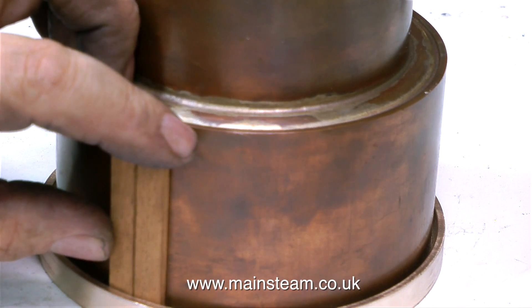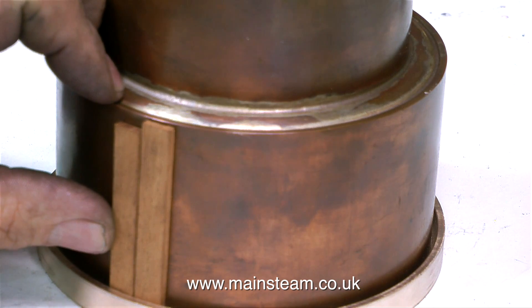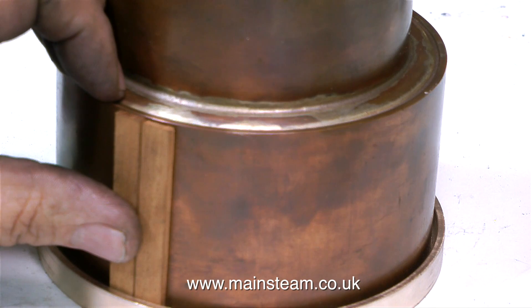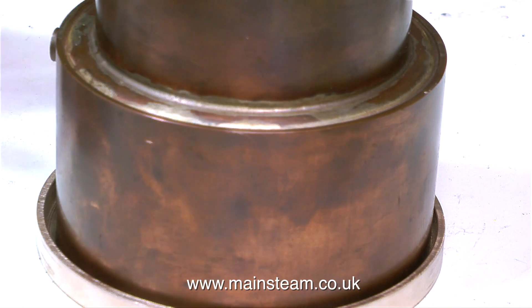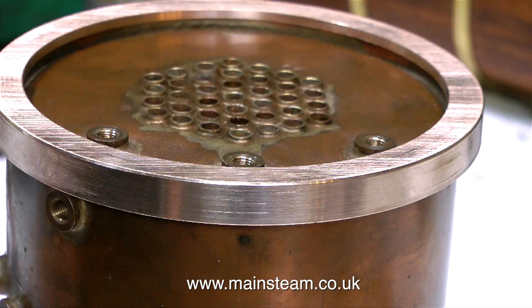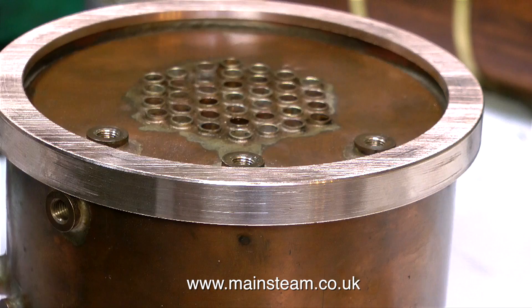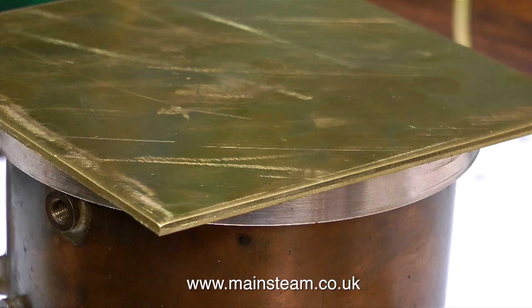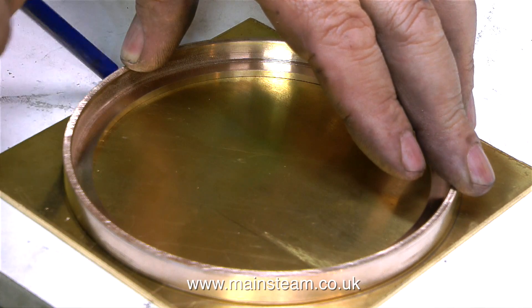I've machined the inside diameter of the top cap approximately 6mm over the size of the existing boiler, which is 5 inches in diameter, because all the way around the boiler are going to be some 3mm thick pieces of mahogany. What you usually find with model steam boilers is that the mahogany cladding butts up against the top cap all the way around the boiler, but it can look messy. With this top cap overlapping the mahogany it will look incredibly neat.